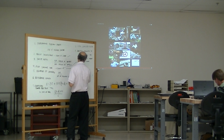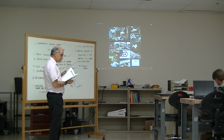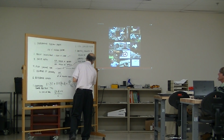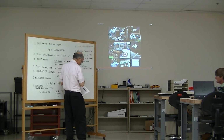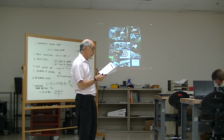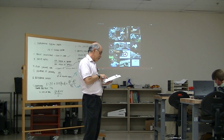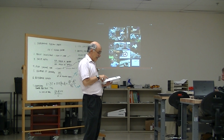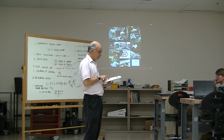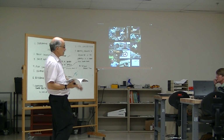And then step 10 is to select your sheave. And so again, you're going to have a chart for this. And on the left side, there's going to be your different sheave diameters. So if you're using, for example, for an A belt, a 7-inch sheave diameter, and you look across, it's going to tell you you need an AS74, or an AK74, or an AK74H, or a BS80, or a BK80. It's going to give you a list of the sheaves that will work under that application. So that's the 10 steps of designing the entire system.